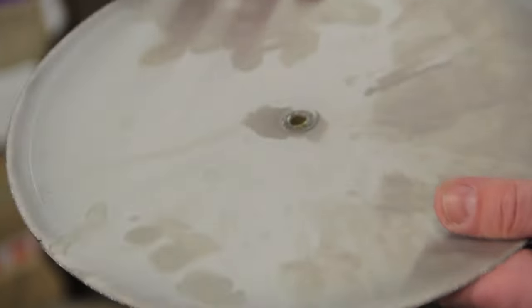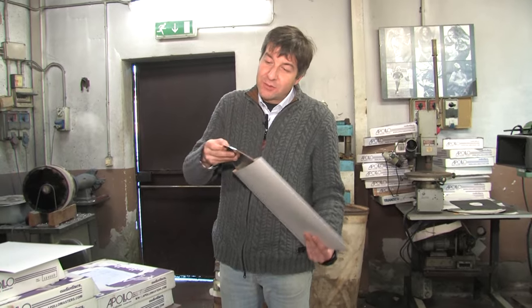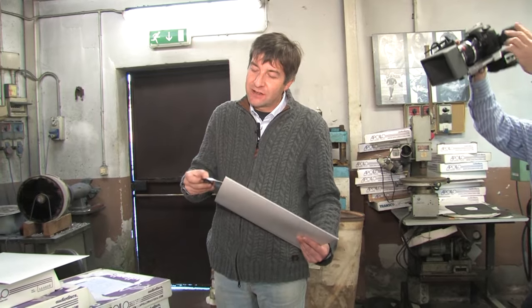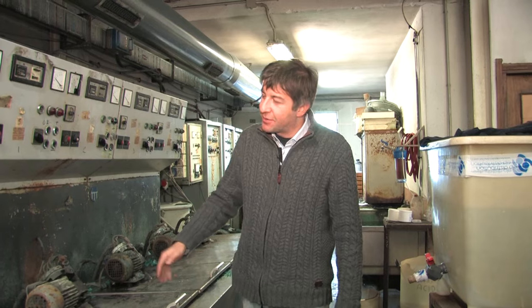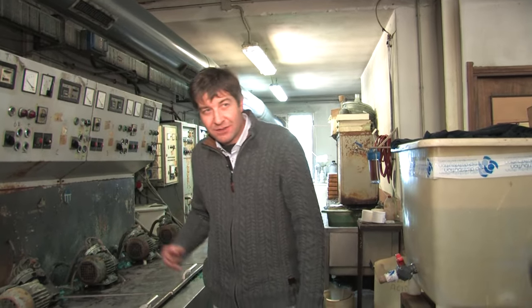To be able to make more negative stampers, a positive should also be made. This negative is performed and centered, but it is a negative. For all titles we also make the positive, so we go from metal to metal. The galvanic process is repeated again, this time on top of the negative. Before doing this, a detaching yet conductive layer is deposited on top of the negative so the new nickel won't stick on the stamper.